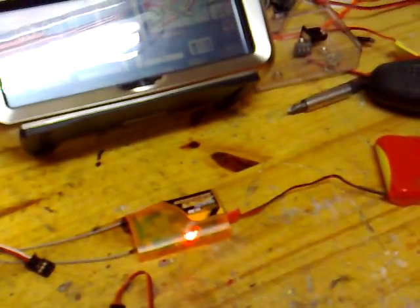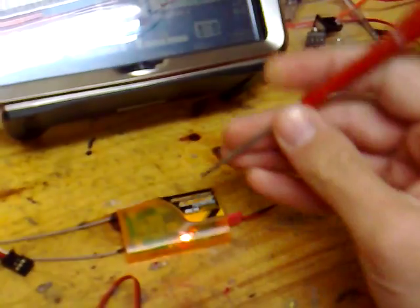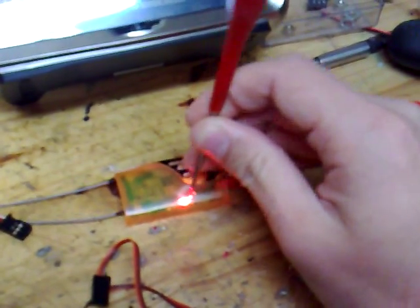So the first thing you would like to do when you get a new receiver is, just in case, change it back to normal speed mode. That is done by holding the little switch on the receiver itself for about 6 seconds. Let's see, holding the switch, letting go. Now you would see a constant green light and then a slow blinking red light. Again, blinking red light means the receiver is not bound, but it's blinking slow, so that's good news. That's regular speed mode, and we can use any servo we want, digital or analog, in this mode.